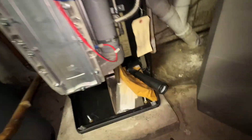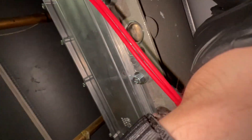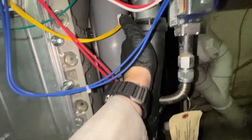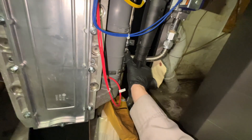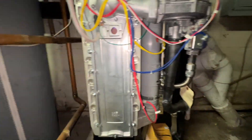We've got the Testo app to do a combustion analysis. I put the slip on there for it and the same for the boiler. The silencer wasn't even connected to the blower, so I got that on there. It's all there now and I'll do a combustion analysis right here — I'll leave my printout there. Got that off the trap.